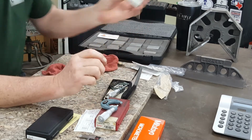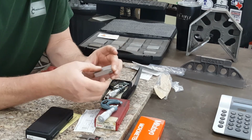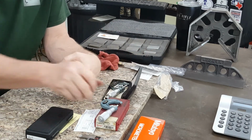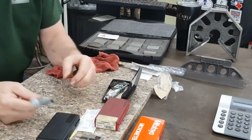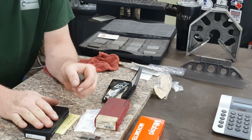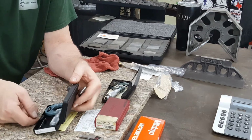And I don't remember what his thought was. These are for welders, you know, again, and I like to use them for machining or welding or stacking up, just whatever. But it is approximately 1/2 inch, within a thousandth of being a 1/2 inch, according to this brand new micrometer, Mitutoyo. And I've got better ways of measuring that somewhere. I don't have any actual standards with me. I wish that would have come with a standard in here, but it didn't.